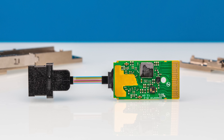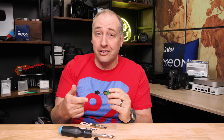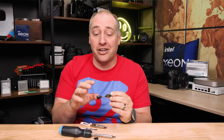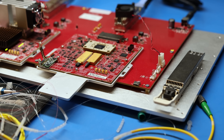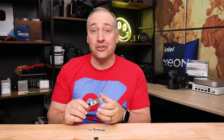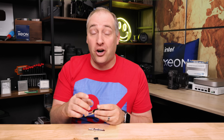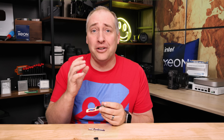It's a very small PCB with very few components, and that's why a module like this can be produced in high quantity, very inexpensively, because if you're only going 100 meters you don't want something that costs a ton. This is a pretty simple optical module, but it shows you the spectrum. Think about it — this is 100 gigs at 100 meters. When we start talking about 800 gigs at a distance that's 10,000 times as far, eight times faster, the complexity to get something packaged only a little bit larger than this is absolutely wild.